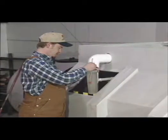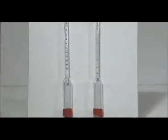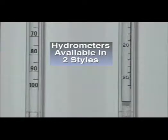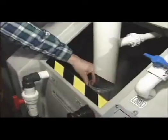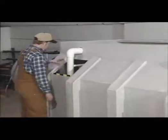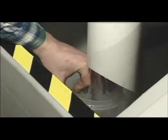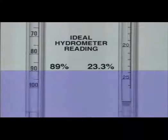Testing for salinity using a hydrometer is a simple procedure. Hydrometers are available from Veritech in two styles. One style indicates the salinity as a percent by weight of salt in water; the other indicates the percentage of saturation of salt in water. Using a common household pitcher or similar container, collect a small amount of brine flowing from each downspout. It's important to collect from both points since their saturation levels differ due to their proximity to the fresh water intake. Insert the hydrometer into the container. Using either style hydrometer, our goal is to achieve a 23.3% water salinity by weight or an 89% saturation of salt in the water.